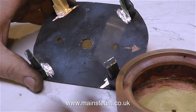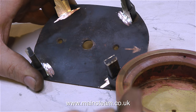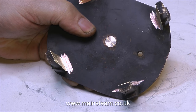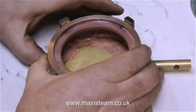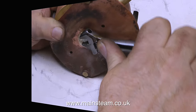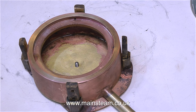The next thing to do is to tackle this hole in the middle of the plate — there's a hole for no reason I can possibly think of, but it's the wrong size for one of these bolts, so I need to plug it. I've turned up a brass plug, then I'm going to silver solder this in place. It is going to go in my acid bath, but not for the moment because I want to test the burner first. So I'm marking out the centre with the burner in position, then I drill a hole through the new bush in the mounting plate, which allows me to use a 2BA stainless steel bolt to hold the burner to the bed plate.